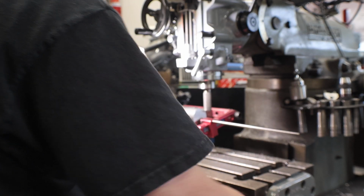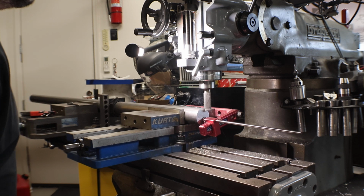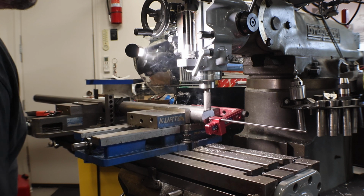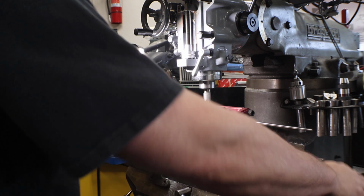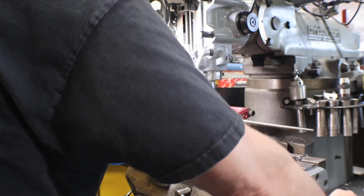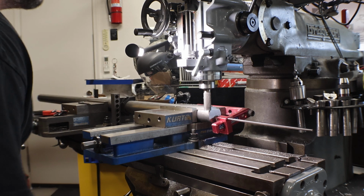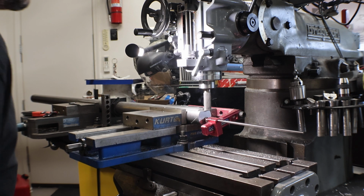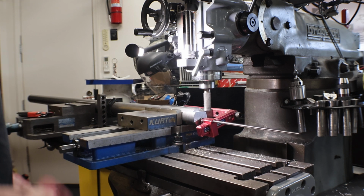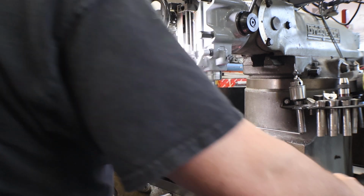And you'll see this cutter with that RPM cuts quite nicely. Great chip action. Lots of heat in those chips, no heat in the part. Okay, so now 100 thou off that, 300. I can do more on the back, or on the conventional cut. It's a little more work for myself and the machine. So, we'll just keep it at that.